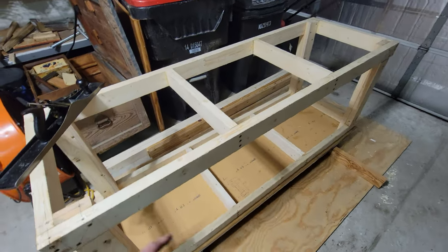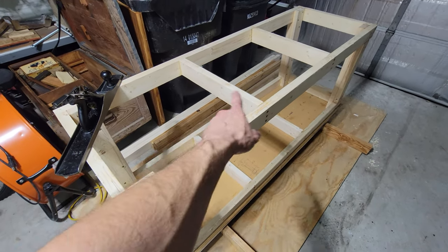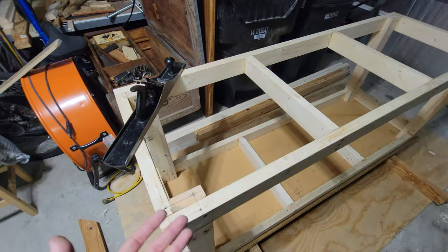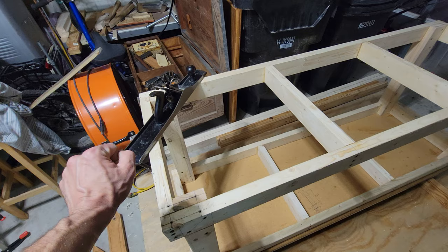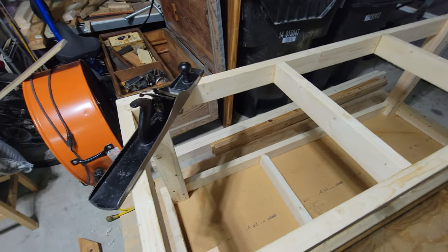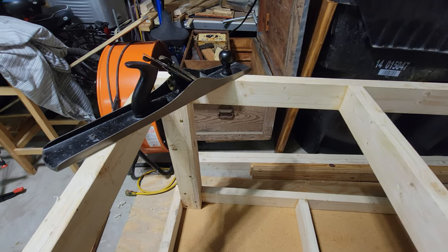I am square corner to corner on all the different sides, but the bowing of the wood left my casters teetering between this corner and that corner. I started off with my cheap very small plane just because I felt silly using this fancy antique — I say fancy because I really adore it — to do this. It's only a short, I think it's a number four, and it doesn't really span the distances very well.